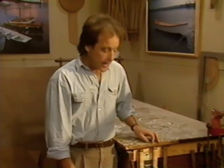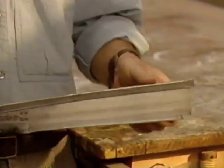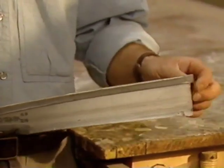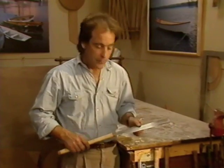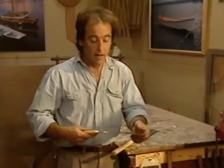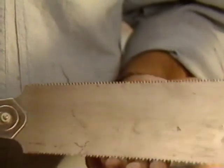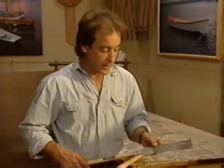For small hand saws, I really like these Japanese saws. This is a back saw — fine tooth, extremely sharp, thin blades, and they cut on the pull. They're amazingly accurate. This one doesn't have a back on it; it has two different kinds of teeth: one set for cross-cutting and one set for ripping. They're kind of new to the Western woodworker, but they're an ancient tool. And once you try these saws, you won't go back to Western push-type saws.